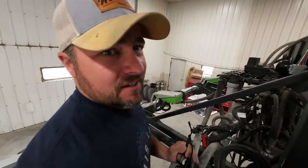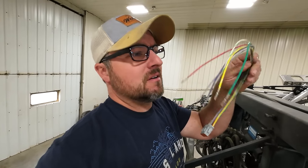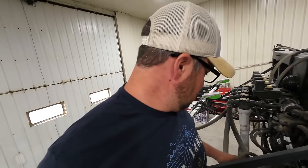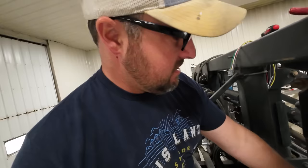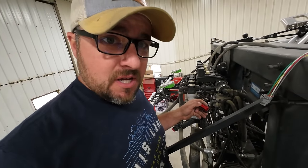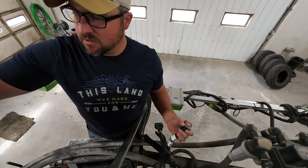Luckily a buddy at Raven sent a chart so I can figure out which pin to put these little pigtails into. Each one of these wires has a crimped end on it that goes into the connector. What I'm doing right now is going through the pins and finding out which pin has not been taken - which slot doesn't have a wire in it. Going off his chart here, it has pin 11, pin 14, pin 22, and so on. As I go through these harnesses I'm finding out which pins are not taken, and if I find the right harness that doesn't have all those pins filled, I'll plug them in.